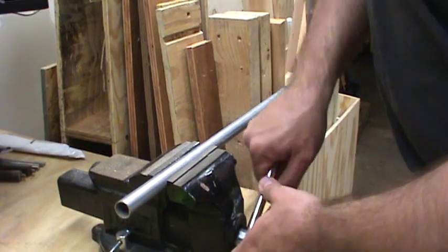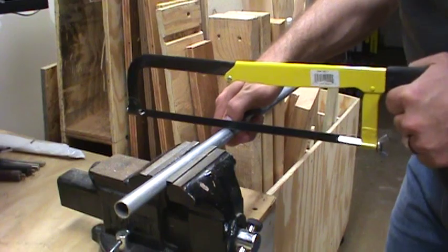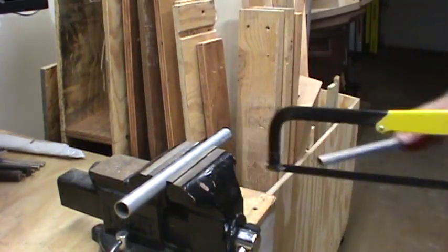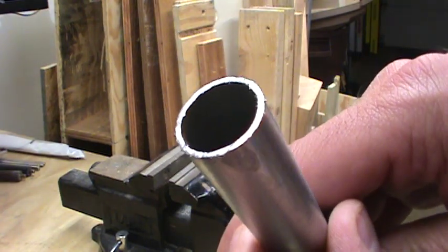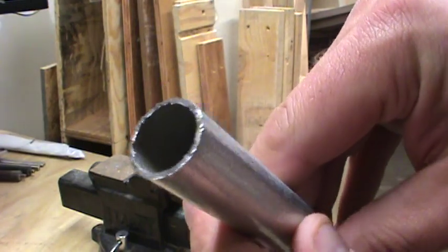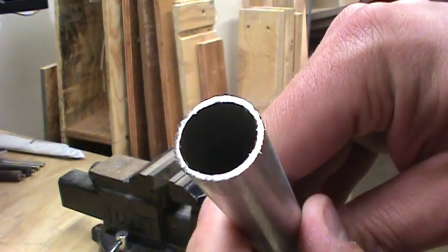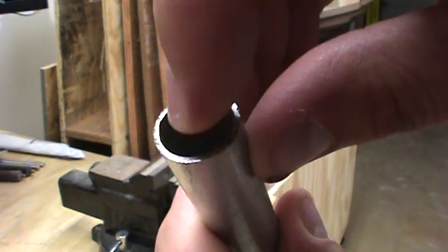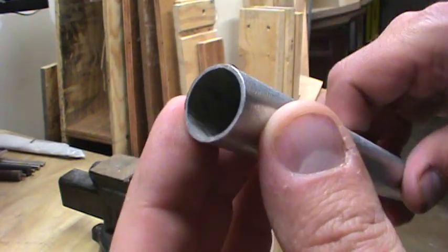Adding this conduit to the system probably isn't necessary — I'm not an electrician — but I had the scrap and it seemed like a good idea to keep things tidy. There are a lot of sharp burrs on this pipe, and you don't want to leave those because they could potentially cut into your wiring and short it out if they get all the way through the insulation. So I've got to file that stuff down for nice, clean edges, ready for wiring.